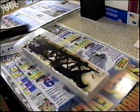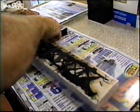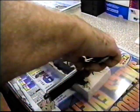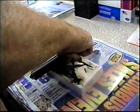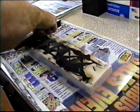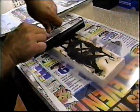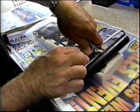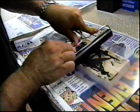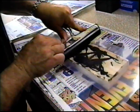And you're going to machine that flat or sand it. It won't matter when you're done. Just try to squeeze out the air bubbles as you do that. Good. It looks sloppy, but when you're done, no problem at all. It's always easy if you start in the end. One end doesn't matter. But we've got plenty of carbon in there, baby. See all the oozity boo coming out of there? Yeah, we're getting all of that. And then we'll let it sit overnight. And tomorrow you'll have your prototype crutch.